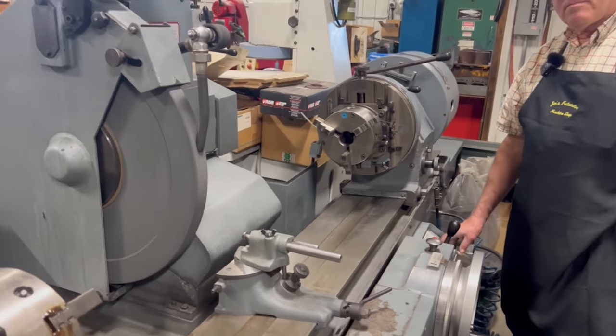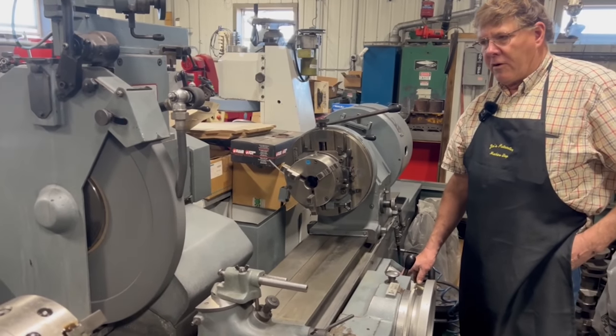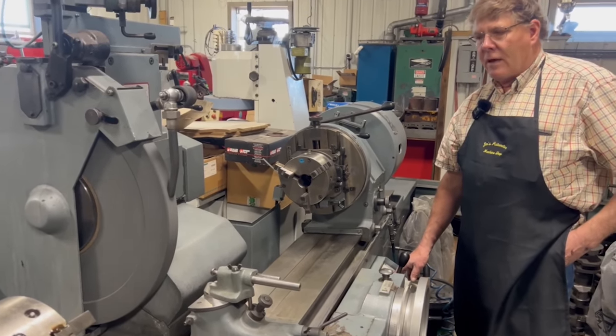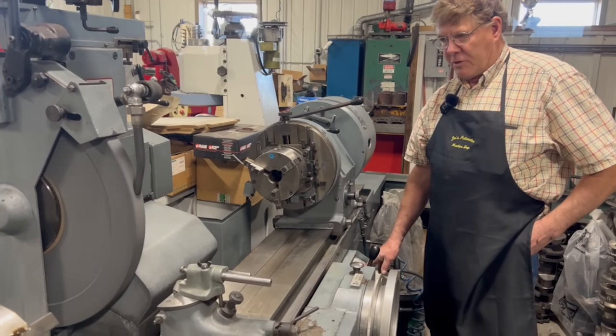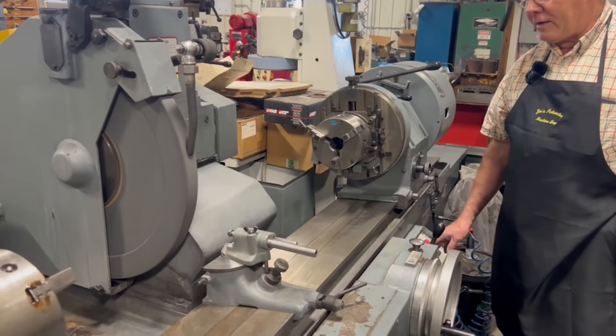So why'd you do that? It's a little easier on the motor. Okay. When you start a big wheel like that, help it get momentum. Yeah, help it get momentum up without drawing so much current for so long. Gives it a little time to cool the windings.